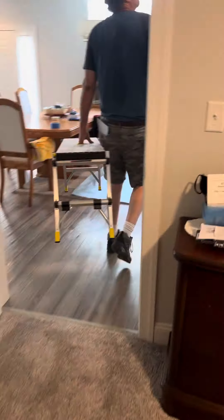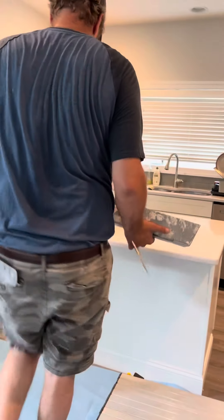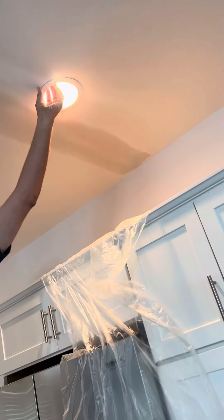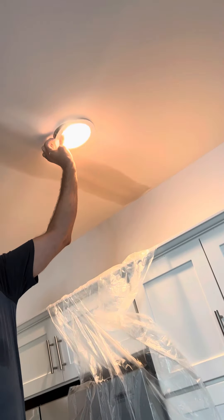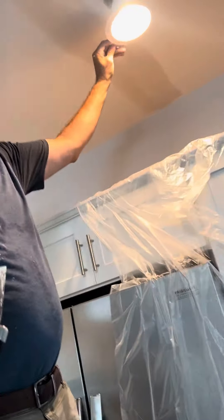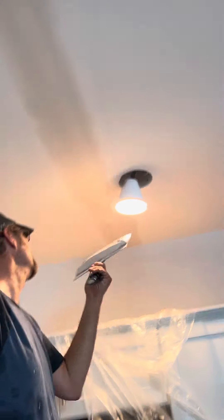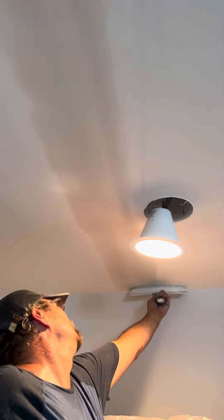You can do this with a regular kitchen sponge, but I use a pretty good-sized one. Honestly, I don't like the results as well as sanding with a sanding pole — that won't take me very long at all. This time I'm going to pop this down a little bit so I can come underneath it. I don't want to get mud all over the brackets here. I'll blend it in — see, just a little bit.